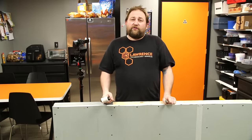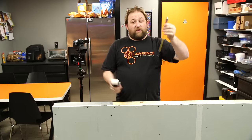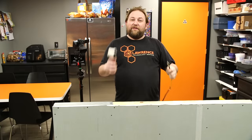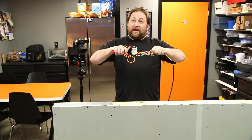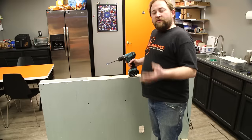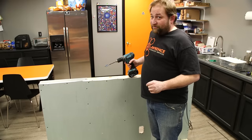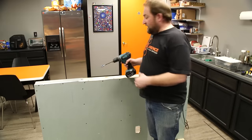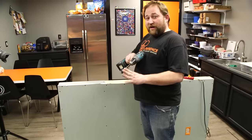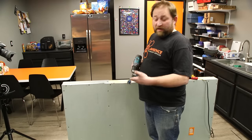For our final method of wall fishing we're going to use the magna pole. I've already connected my wire, because once you drill the hole for the magna pole you're almost done — it's that simple. The magna pole is a super powerful magnet that attaches to the wire. Keep in mind: when using a magna pole you cannot use it when you have a fire stop in the wall — you're just not going to get that big magnet through that hole. I always try to use a bigger bit with the magna pole — in this instance I'm using an inch-and-a-quarter bit.